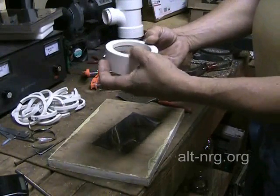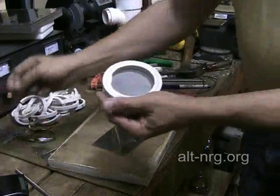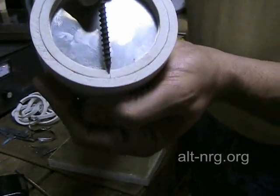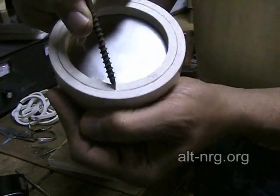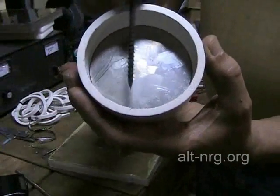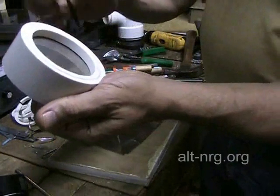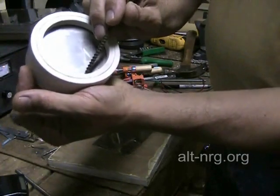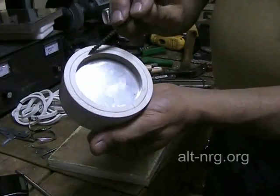The more I look at this, the more I realize what I'm going to do. At the point where I've created a seam on the C-ring, I'm going to take my Dremel tool and create an opening at the bottom. That opening at the bottom of the spacer ring is going to be larger than the opening I create at the bottom of the stainless steel plate, because the 3M adhesive I'm going to use will seal off the edge of the plate. That way, the electrolyte can flow underneath the plate without actually touching the plate, and the same goes for the gas exiting the top.